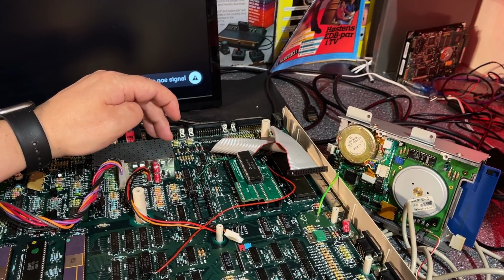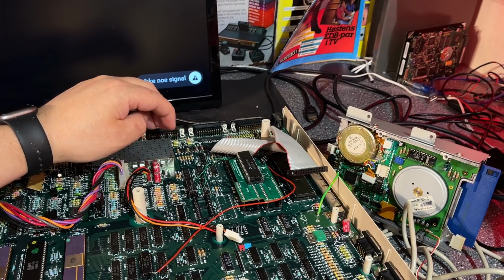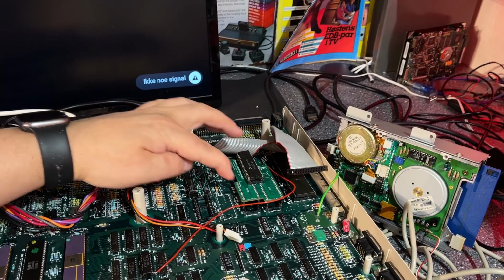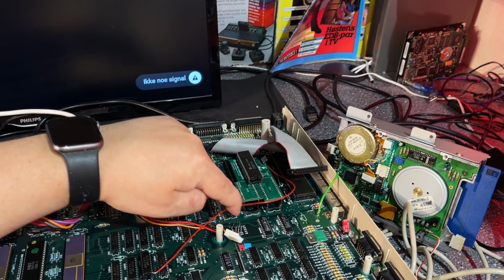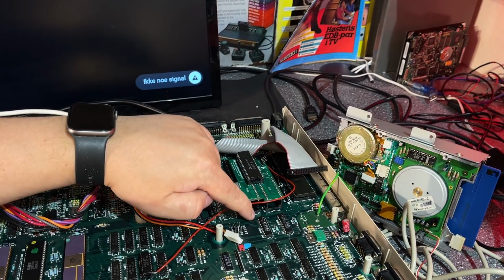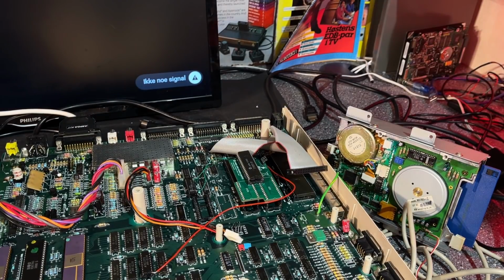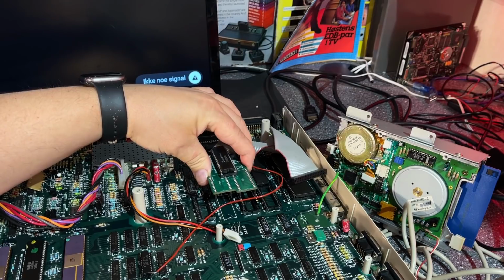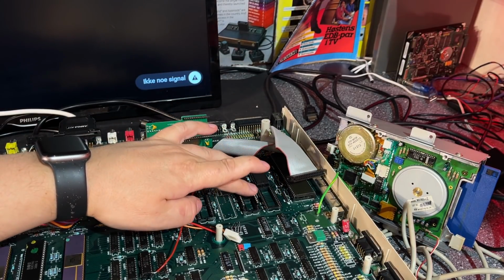Okay, I realized I have done a terrible mistake, and many of you have probably screamed at your screen and said no, no, no to the video already. But the thing is, I have placed the module the wrong way. It should be onto these two chips, the odd and the even. And of course now it is completely wrong, so I just have to solder in a new socket, but that isn't a lot of work, so well, just have to do that. So it is supposed to go here. And the picture I've been looking on for the recipe of this mod is correct, of course.